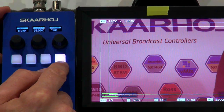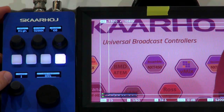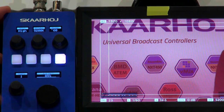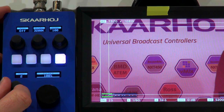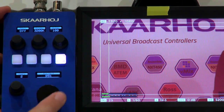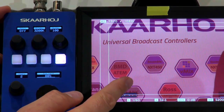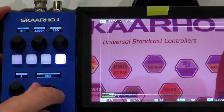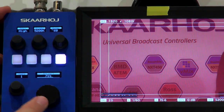You'll also notice that when you are at the fourth menu position, the camera is set to Camera 1. As I turn this knob, I'm now at Camera 2 — and you can see all the settings in the displays are changing. So what happens if I adjust the iris now? Nothing, because the camera was set up to ID 1 and I am pushing out data for Camera 2, so the camera doesn't react. I go back to Camera 1, and of course it reacts to whatever I do.